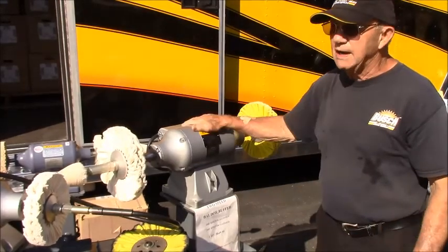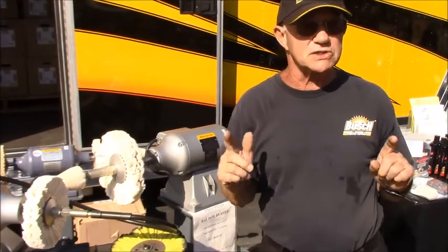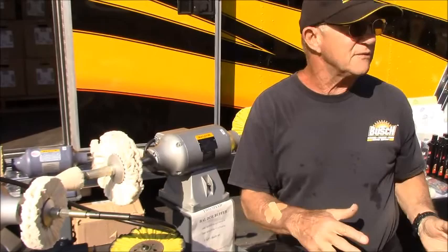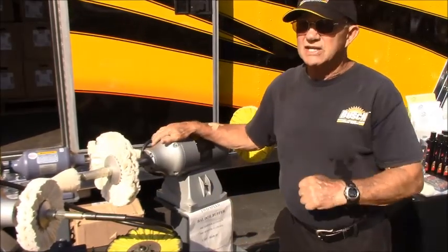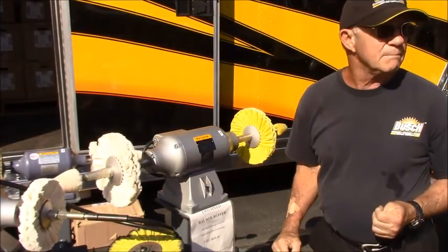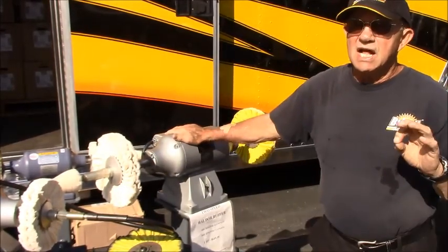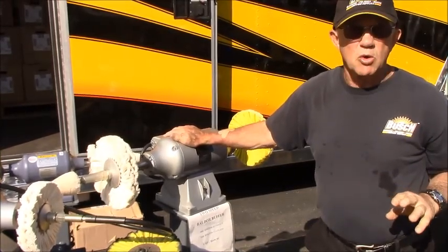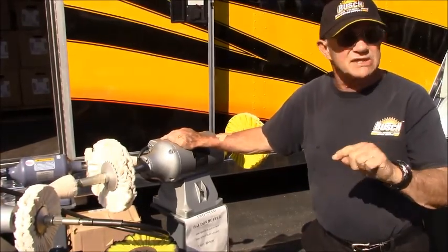Whatever you have in your hand when you walk up to this buffer, you can do it. The mantra is: SS — soft is slow. HH — hard is high. Soft means aluminum, other non-ferrous products, brass, silver. Hard is high — that means stainless steel, carbon steel, knife blades. That's your high RPM because the rouge bars you use when buffing that stuff have hard metal particles, and it takes more mechanical energy — higher RPM — to break the rouge bars down to do both the cut and the shine.